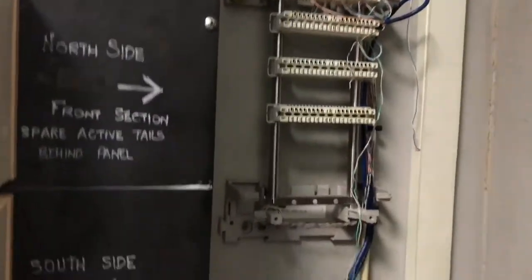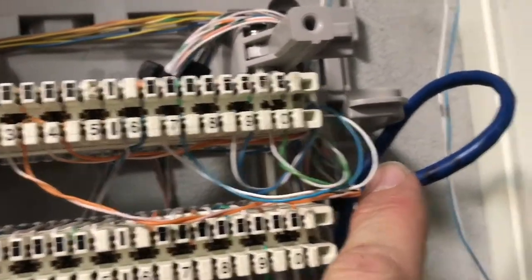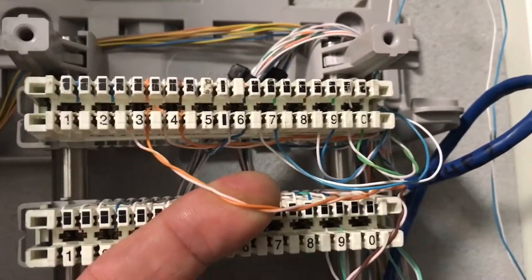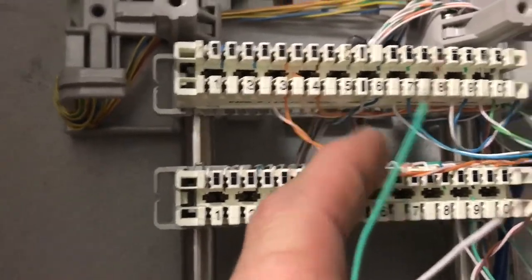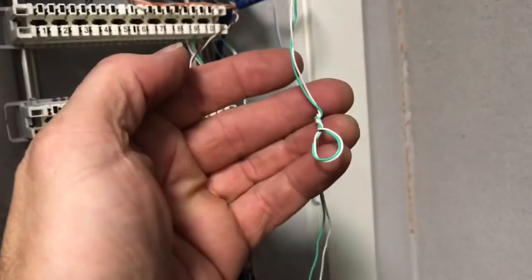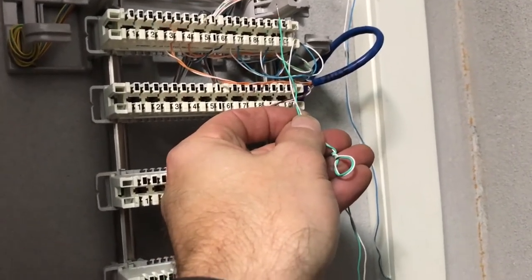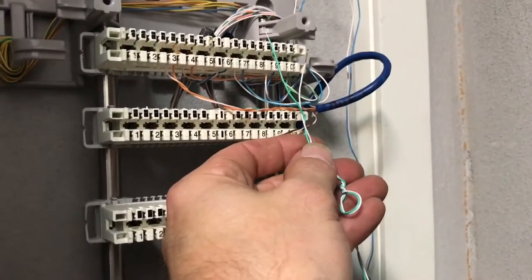The IDF is nice and clean as you can see. But we had — I don't know if this was supposed to be like this, but obviously it wasn't. So you had this cable, number zero at the end there. You've already got this pair patched into it, which runs back on the same pad five, which goes back to another socket. This orange cable is the one for your phone for the alarm system, but that was in zero as well. So I've patched it into number three now — it's got its own separate line down to the MDF — but it also had this other cable patched into it as well. So there's three cables, and you're getting a short circuit across it because I don't know where these are going off to other equipment. Somebody's obviously put this in and it's creating a short circuit.